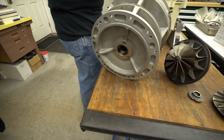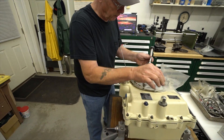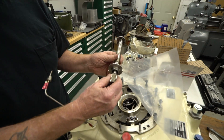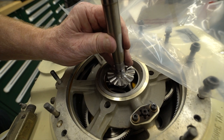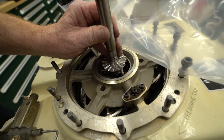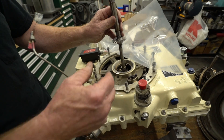This comes over here — this is a gearbox; it's got a planetary in it. This pinion shaft right here is all made to fit right inside here. So that's the driving mechanism, and we convert 60,000 RPM here to a 10.1 to 1 reduction so we get 6,000 RPM out. That's what everybody uses — a 6,000 RPM output.